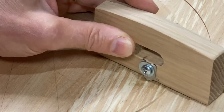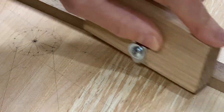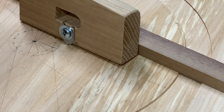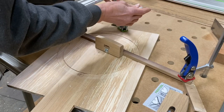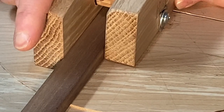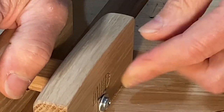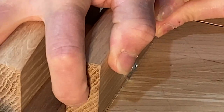If I just put a slight mark in I can see on either side just where that cutter is going to come. Looks like it's placing right where I need it on the line. Because it's beveled on both sides, I'm going to be pulling each direction across the grain. Light strokes to begin with — I don't want to be pushing the fibers away, just like when you use a plane you start with a lighter stroke. I also want to make sure my material is not going to shift on me, so I clamp this into place. The block on the opposite side helps me score the lines right. Once I have those lines scored I can remove the other block because it will follow in my scoring line. Light score marks to start.